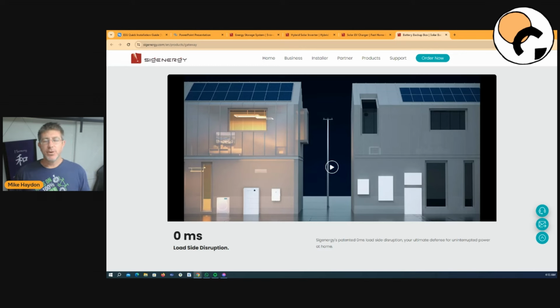So how an AC coupled system works is you've got a typical grid connected inverter. In an off-grid situation, normally we've got a big shed. How we've normally designed and installed systems over the years, the customer buys a big shed, slaps a load of solar panels on top, puts the batteries in there, and we put enough panels up on the shed. Sometimes the shed's not big enough to create enough energy for the customer's needs when they build their house. So what we typically do, and it's easier because you only need to dig one trench, is run a cable from the shed over to the house.